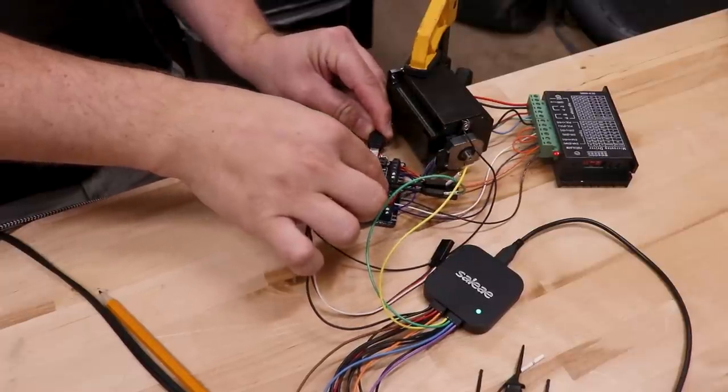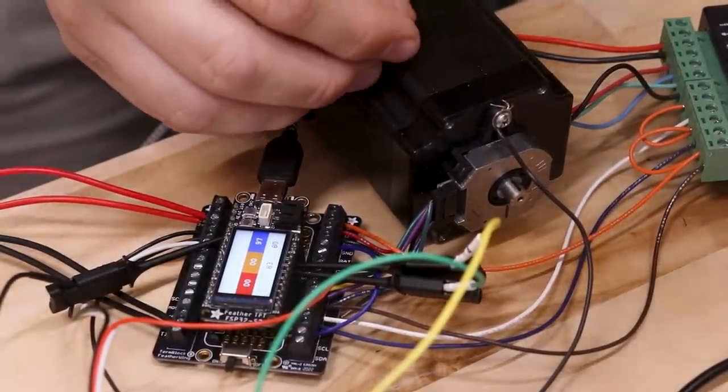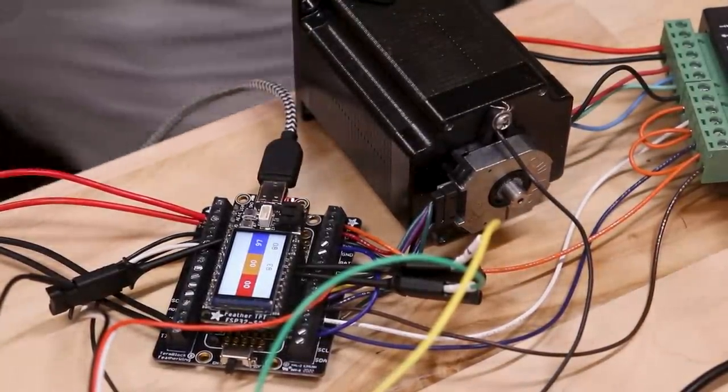I've got to be honest with you, I made a very embarrassing mistake that cost me like several weeks of frustrations. I've been working on the code on the microcontroller that will read the pulses coming from the encoder. I've worked with encoders lots of times before, and so I was very confident in how I was going to approach this problem. Well, it turns out that the way I have always done it actually introduces a little bit of an error as it's counting the pulses coming from the encoder.